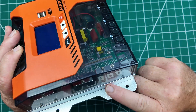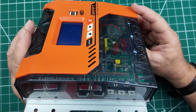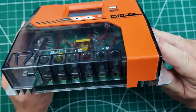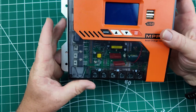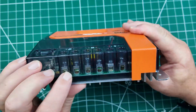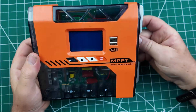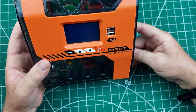You've got a couple of coils in there — that's the main thing usually with MPPT — and you've got some MOSFETs and stuff as well. I'm not an electronics engineer, but I know I've had really cheap controllers before where it was just MOSFETs instead of coils. It's nice to see through the window. You can get them in different amperages, and there's quite a nice screw terminal on top — the clamping is slightly different to some others. It comes with a bit of a heat sink as well, which is always nice to see.